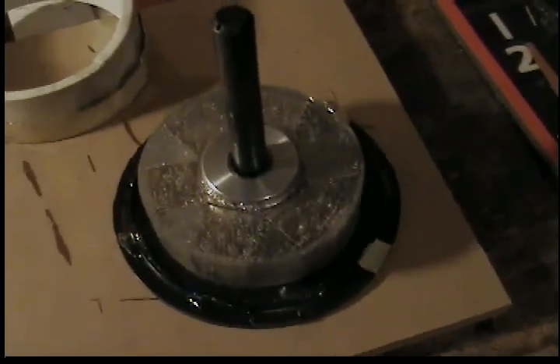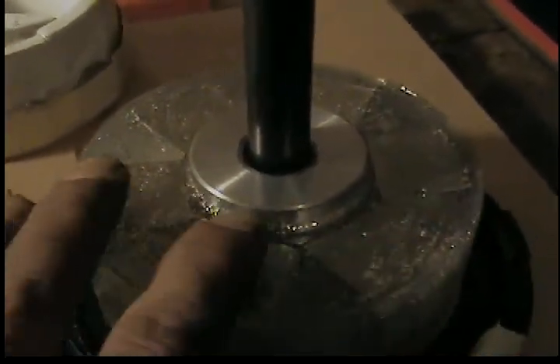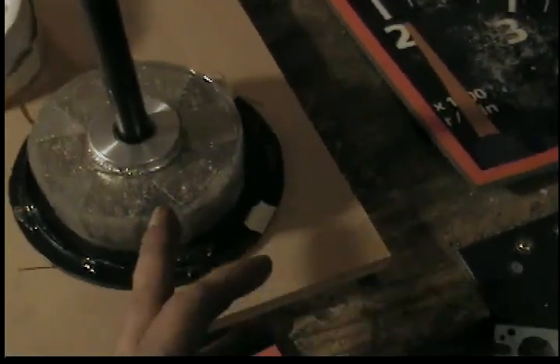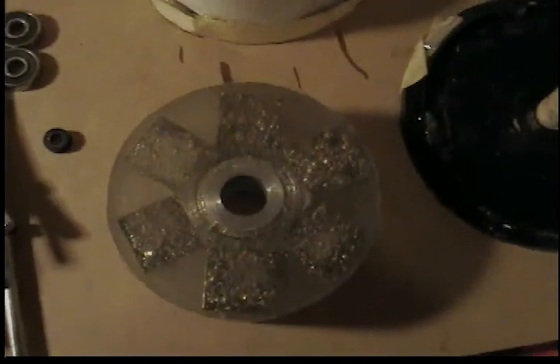Now we have the aluminum shaft. I'm going to let the rotor cure at least overnight again — I just did this last night and it's solid. It was a little tacky this morning but it's been outside all day and the tackiness is gone. One thing it does have is a lip on this side from gravity curing. I cut it down with a razor blade while it was still a little soft, but I want to try to true it up on the lathe, both this surface and both flat surfaces. The other side is pretty decent as it sat on the flat of the CD case, but the top side has a bit of a lip from gravity. If I can true it up on the lathe I'd be happy. I don't know if the plastic is designed to be machined or not, and I don't want to build another one — but if I have to, I have to.